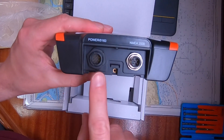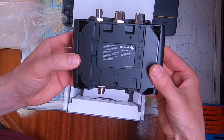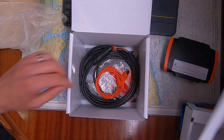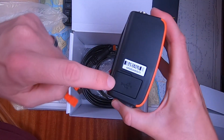On the front there is a power and NMEA output, and also an NMEA 2000 output. It features a bracket design on the back so you can click it into place. Included in the box is a USB cable to connect the device to your laptop or Mac so that you can configure it. Here's the USB port on the side of the device.